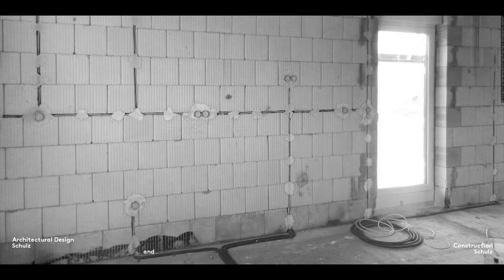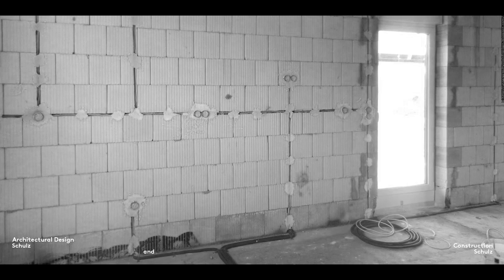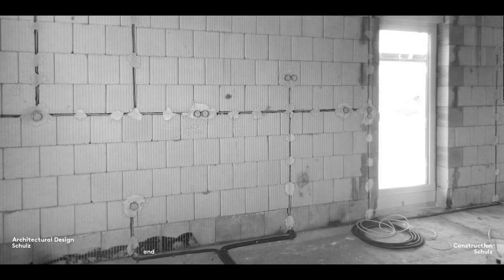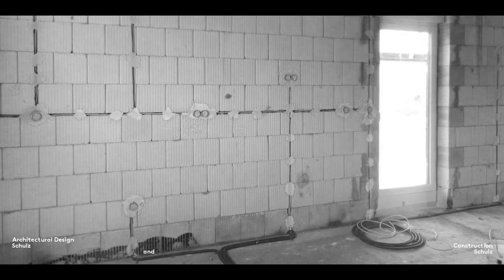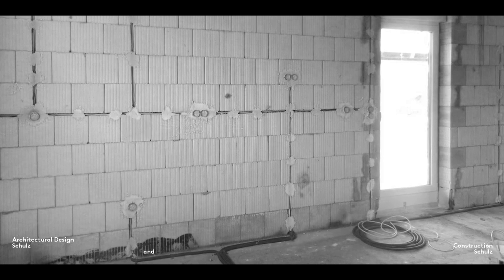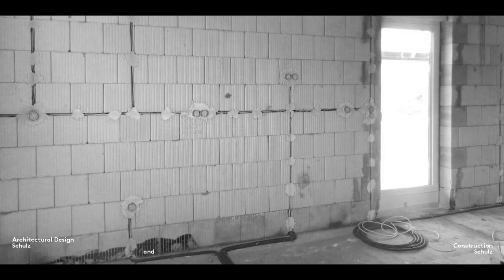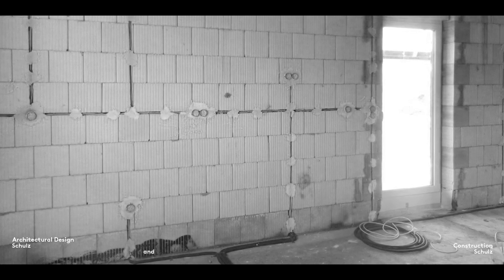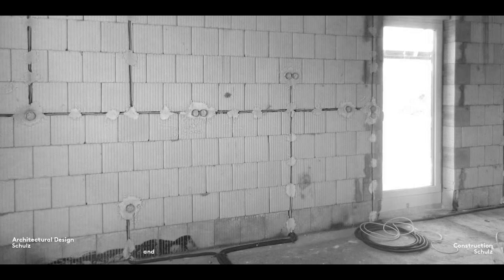You have probably never asked yourself how the wiring in your flat or house reaches the sockets and switches. Cables are traditionally laid under plaster, but as cables become thicker and thicker and plaster thinner and thinner, they are now generally chased into the masonry. Horizontal cables are generally laid close to the floor or just below the ceiling to avoid any risk of drilling into a cable when hanging pictures, for example.